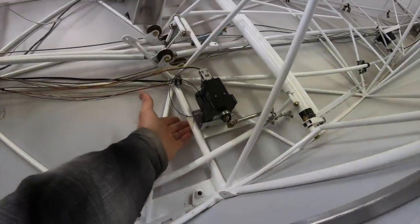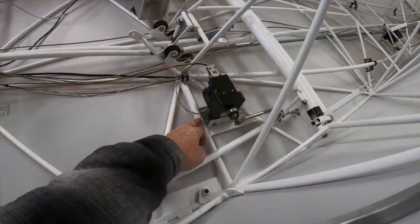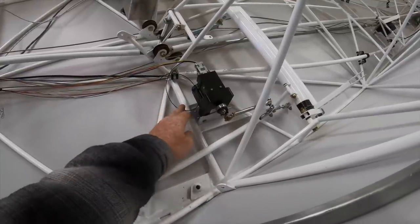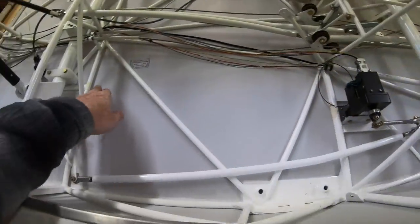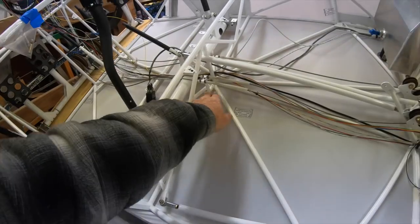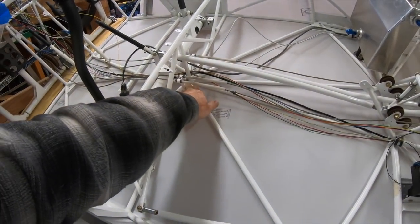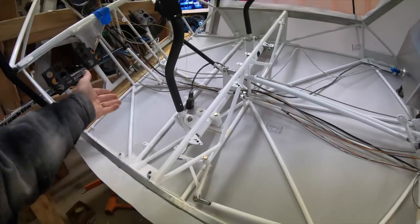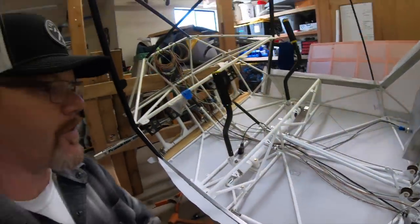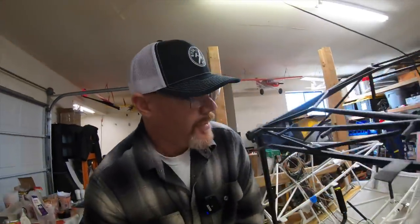So I put it underneath the servo mounting bracket where the rivets are, because the rivets will contact the fabric. There's a little bit of rough area underneath this tube, so I put chafing tape there. And under the cluster here, I was recommended, because you're so close to the prop wash, to put some there as well. So I haven't really found a whole lot of places to use the anti-chafing tape.